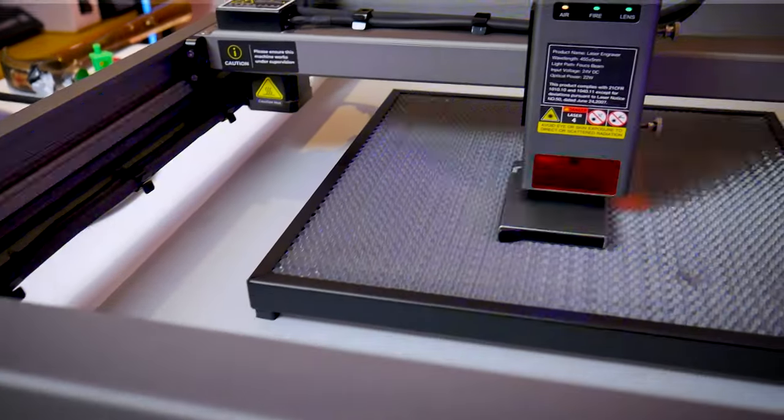We'll come back to lasering more materials in a minute and I want to take a quick break to show you guys a fume extractor upgrade that I designed for the 22 watt laser module. I've designed fume extractors for other laser engravers in the past and they've been very effective at sucking up smoke and fumes at the source. I'll be making this version for the 22 watt Falcon available on my website. There are three pieces to this kit: the top piece is the Y adapter and the other two pieces are the nozzles — a left hand and a right hand side. The nozzles will mount to the Y adapter with some M3 thread forming screws. The mounting holes have been designed so that you can't put the left hand side on the right side — there's only one way to mount these and those mounting holes will only line up in the correct orientation. Once we have those holes lined up we just simply screw in the M3 thread forming screws which will cut their own threads into the plastic. There will be four of these screws in total — two for each side.